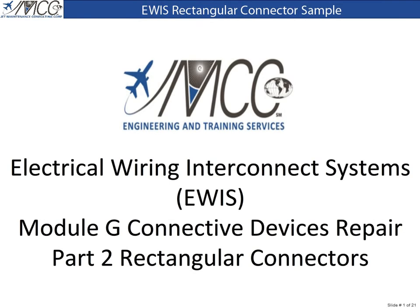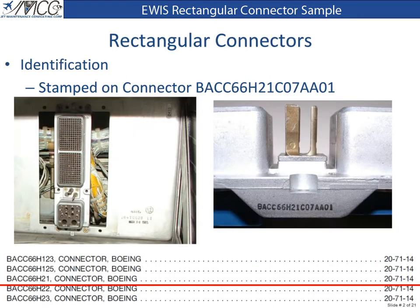Welcome to Part 2 of EWIS Module G, which emphasizes the repair and replacement of rectangular connectors found on the aircraft. In this module, we will discuss procedures used in preparing and replacing line replaceable unit rack connectors. We will discuss the tooling and procedures required to accomplish these tasks. The example we will use for demonstration purposes is an ARINC 600 series connector.